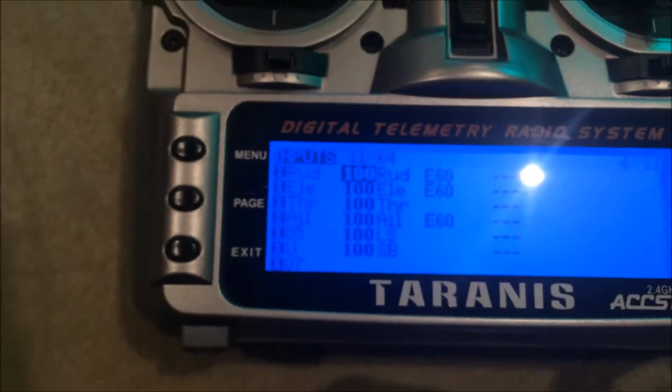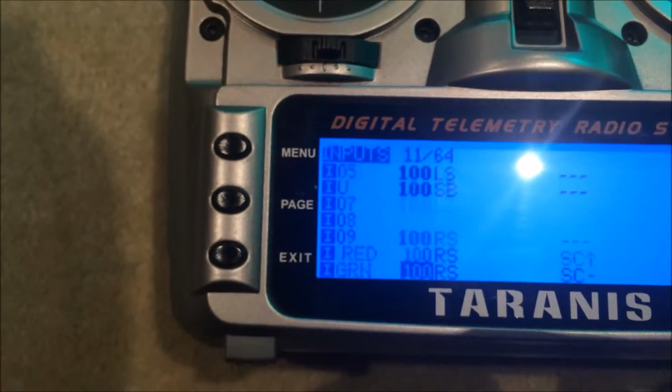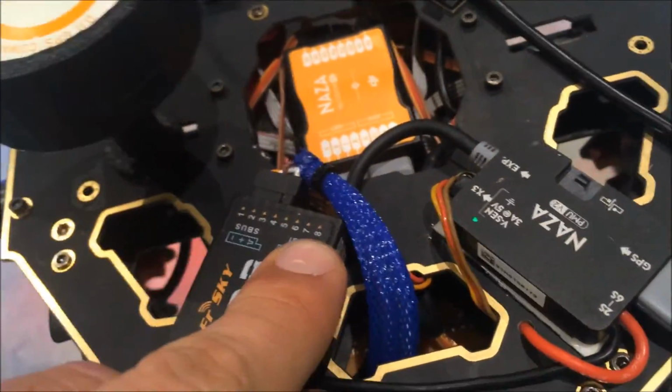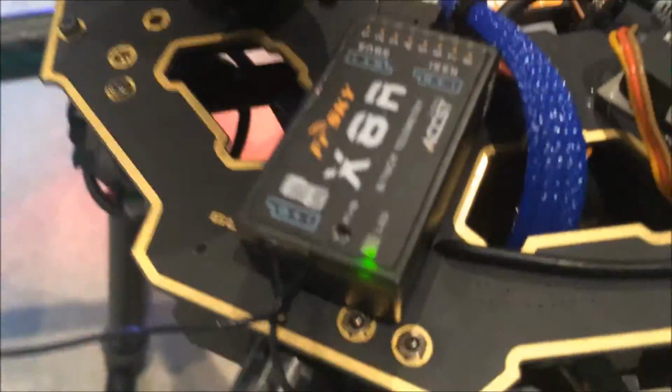I've got all my inputs here, right out the throttle, and so down at the end I'm powering my receiver. My controller is through S bus, so I've got an extra 8 channels across here. Down the bottom, I've got one, I don't know if you can see it down here, that's for all of the control for the actual hexacopter, and then these 8 channels I can use for just external things like the parachute and the LEDs.